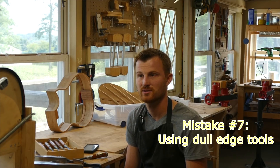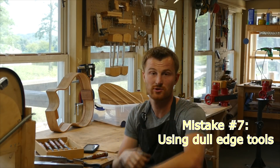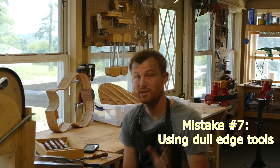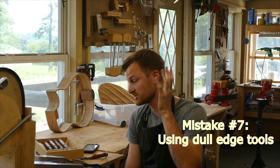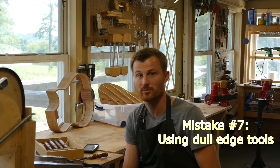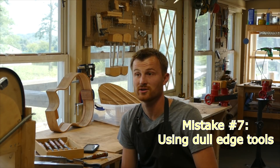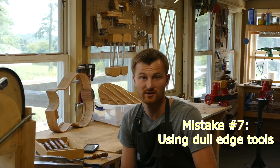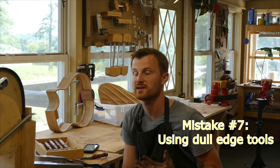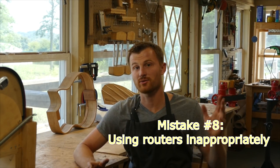Your tools don't have to be scary sharp — they just have to be workably sharp. And when you buy new chisels from a store, they are not sharp — manufacturers don't sharpen them before shipping because they'll dull in transit. They expect the buyer to sharpen them. If you're not going to learn to sharpen at all, just don't use hand tools — get by with router bits and power tools, or use sandpaper and files instead of dull planes and chisels.